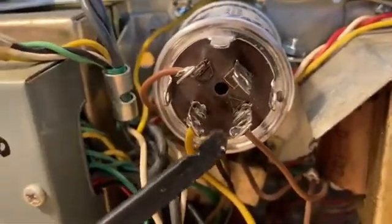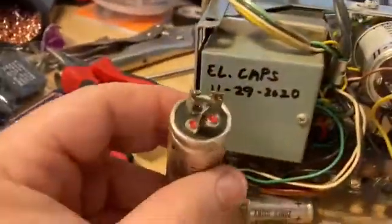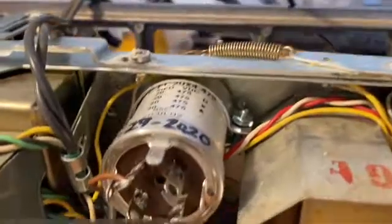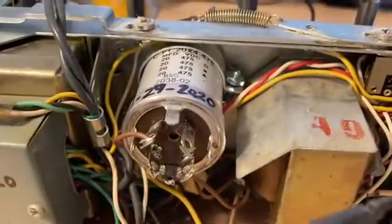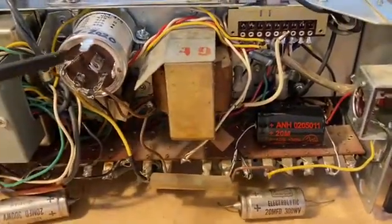The two brown leads that you see there are the original two leads going to the red, and then the black is the ground. I have one additional 20 microfarad tab capacitor that I'm not using — it's just left empty. You can also get a 20-20-20 three-section capacitor. I bought the four-combination just because I wasn't sure if I wanted to eliminate this one also. I decided I would leave this one here, and the price for the three-section and the four-section are basically the same.